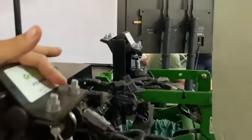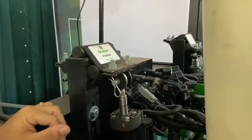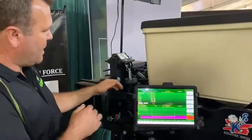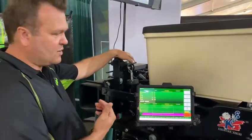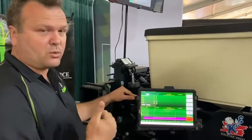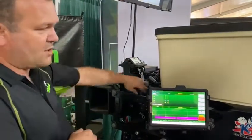That speed allows a smooth ride as you go through bumpy soil or contour dips. We also have our torsion clamp, which provides about 250 pounds of stored energy. If a row unit dips down into soil and the actuator can't react fast enough by itself, the stored energy pulls the row unit down to consistently maintain the target seeding depth.